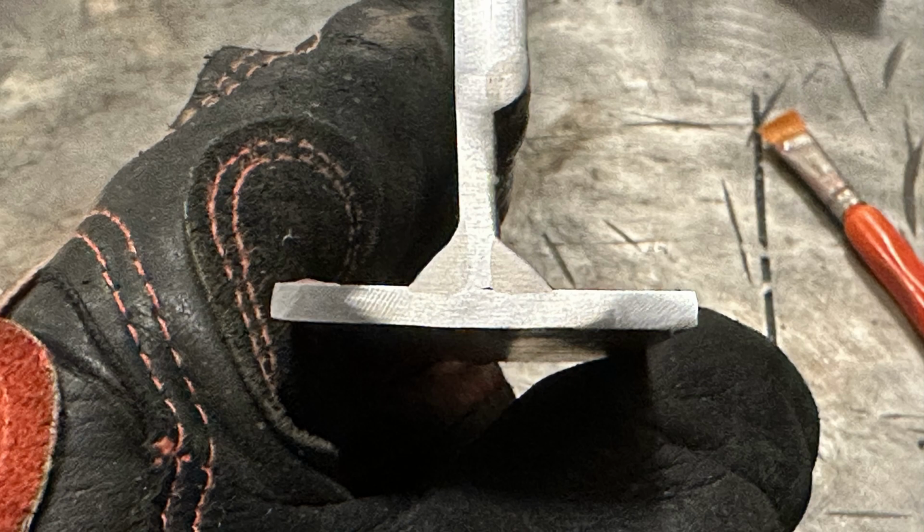Now the two fillet welds I did have a little bit different of results. Now on the right you can see the penetration isn't as good as the left, and I can tell you my theory as to why. Where I cut the plate in half is literally right where that restart was on that right side, so I think the bead just didn't have enough time to heat up the metal to get better fusion, which is going to be typical and is a great example of why you want to minimize your starts and stops, because you run the risk of slightly less penetration at a restart in that general area.